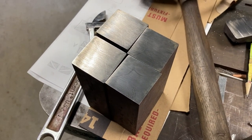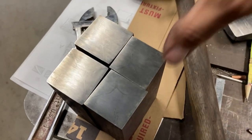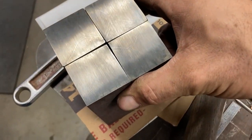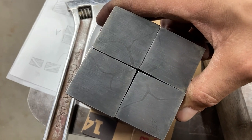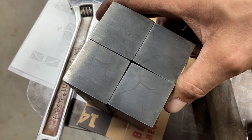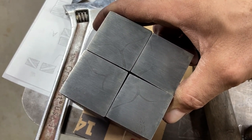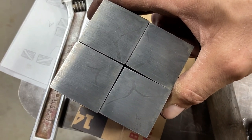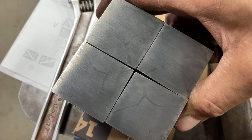I've cut the bar into four pieces and check-etched all the ends. We didn't get a perfect re-square — that happens. It happens less the more practice you get and the more careful you are, but it still happens. In this case, I believe what happened was a rookie mistake: I had used too small of a handle on too big of a bar, you can see how it bent, and that really doesn't help you maintain handle alignment and correctly get the angle on your re-square. That reinforces the lesson — go to a bigger handle size as the billet gets heavier. A number five rebar isn't going to suffice for a billet that weighs 10 to 15 pounds anymore.